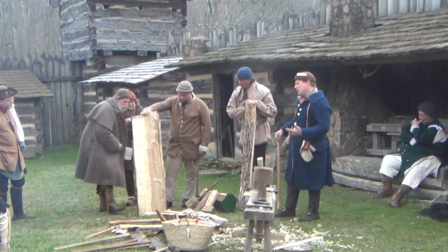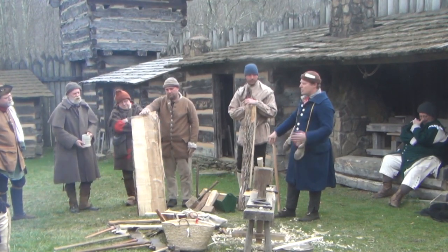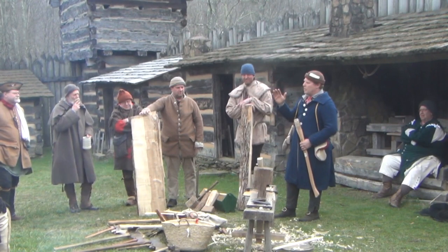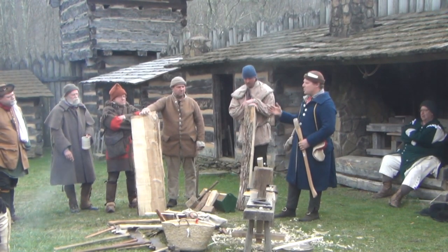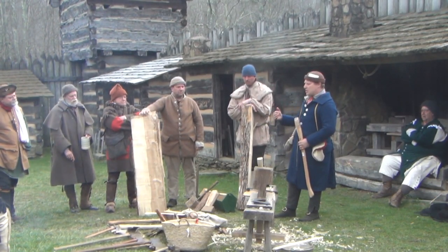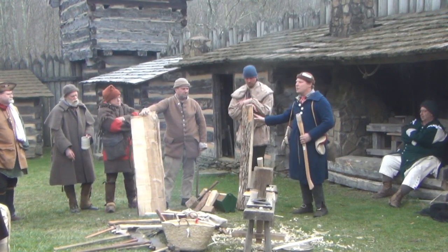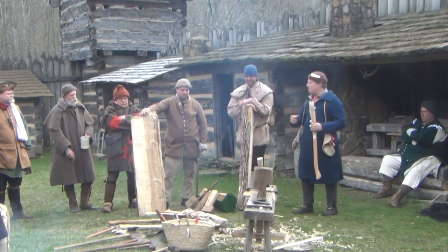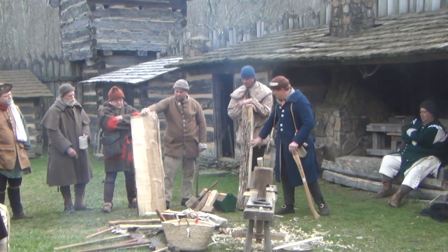So sometimes your best bet is to get a woods tree, something that's tall and straight. If you take a tree down with a sweep in it, where it's grown phototropic towards the sunlight, when you rive and split it out, you're gonna have that sweep in your wood. It's just like splitting firewood. The shape of the tree doesn't lie to you. You'll get the same thing inside it that it's shaped like. So these ones were just split out.